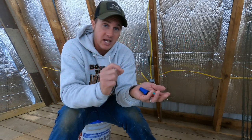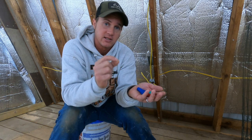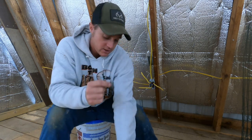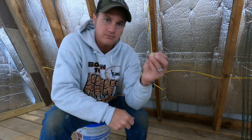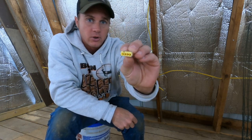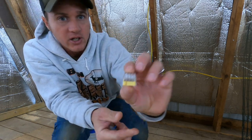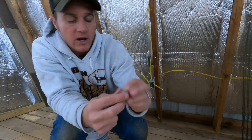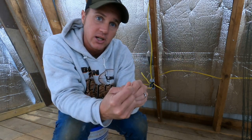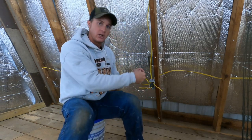I'm going to show you what I think is a game changer, especially for DIYers and people that may not be fully licensed, and for people that maybe don't do this all the time. Here's what I like using. This is what I've used — these are on the lights that I installed in here. This has four slots, it's just an insert. You push your wire all the way to the end of it and it grabs it. So you just take it, push it in, pop all these in, splice them, and you're ready to go.